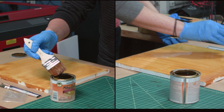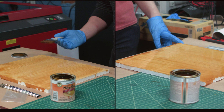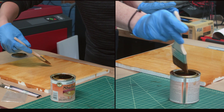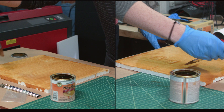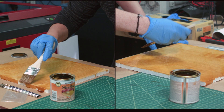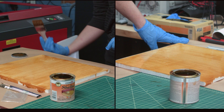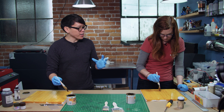I like that on yours it's heavier on the edges — it already reads like a wood thing. If you start at one end and drag to the other, you're pooling all the color at the various ends. What's nice about doing wood grain is wood is inconsistent — you have pockets that are darker than others. You can come in and dab around, then try to smooth it out and disperse it however you like. It's sort of like Bob Ross — there are no wrong answers. That's particularly nice about working with wood: it's all supposed to look a little uneven.